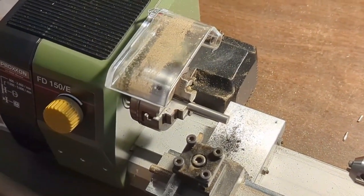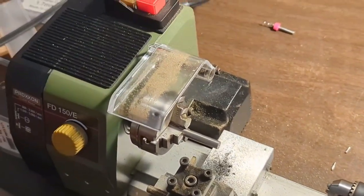Well, the aluminum, at 5,000-ish RPM, does not seem to weld the inside of a molybdenum rod, or a blind hole in molybdenum. It seems to catch sometimes, but it doesn't swell and fuse like it did in the stainless steel or with any of the other collars or shaft liners that we've tried. This just seems to get grabbed. Now, that doesn't mean it doesn't swell and it doesn't mean it won't fuse. It just means that in this particular case, we haven't seen it.